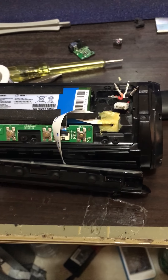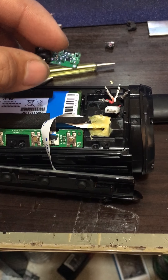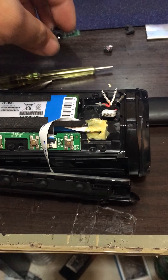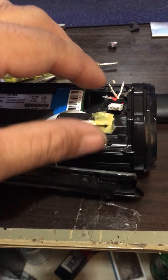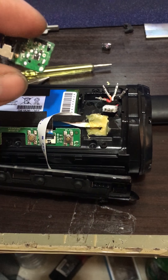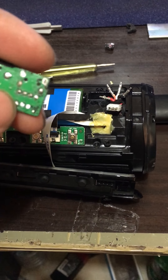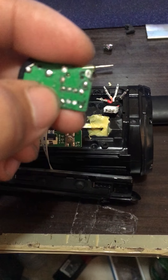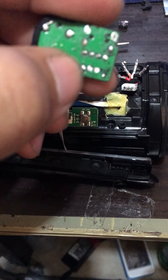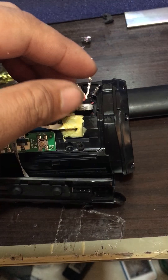So what I'm about to do is — if you're like me who isn't perfect or just has a little knowledge about soldering, you can go ahead and do this kind of solution. Basically, there will be two connectors and both of them are soldered on the board, so you just need to desolder them. Four on the top, three on the bottom, and you can take this off. There's two ports.